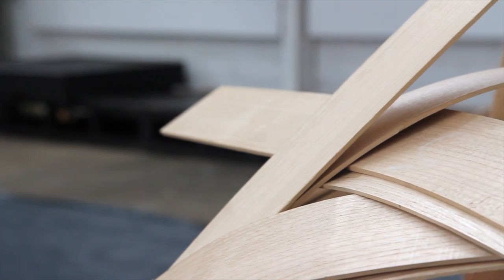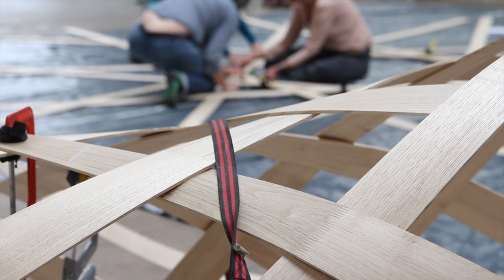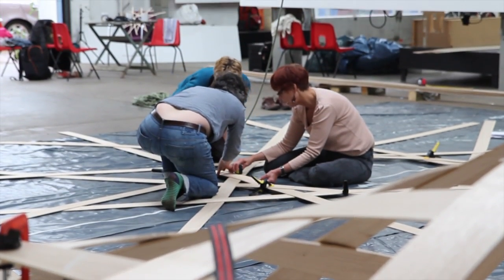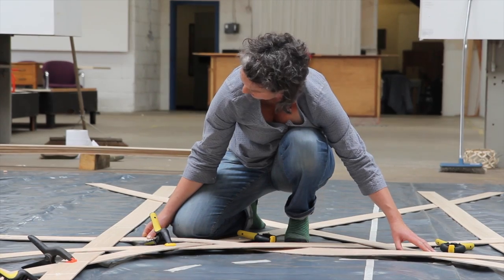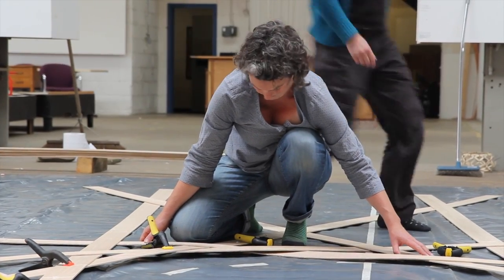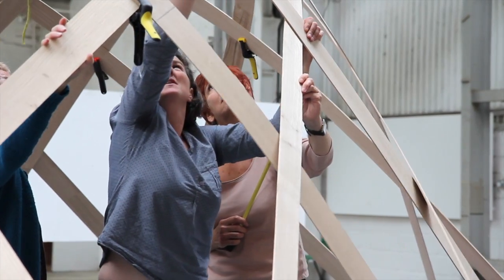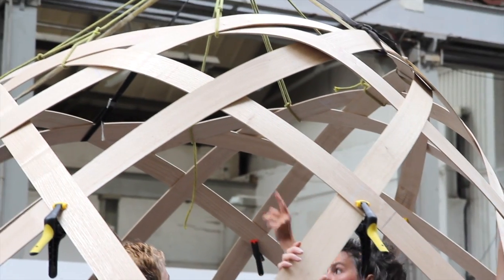The chestnut comes as planks, and then all the knots are removed, and shorter lengths of the chestnut are then finger jointed together. So what I've got is 6 metre lengths and 10 metre lengths, which are fairly uniform, but still there's places where there's a little bit of a risk with them. And I'm using a technique to try and weave those together where I'm not really joining any, I'm just using one big piece and seeing how they work together.